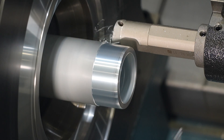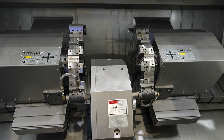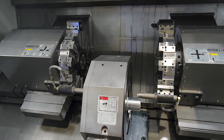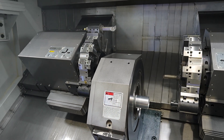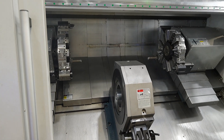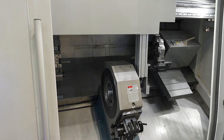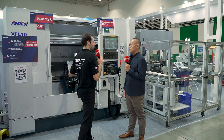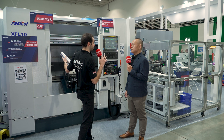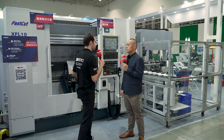How is the machine actually constructed? We put the spindle in the middle and then have two turrets on both ends, which allows us to cut both ends at the same time. So the spindle in the middle has the clamp — simple — and then two turrets either side. That means you can produce many different operations on both sides simultaneously.